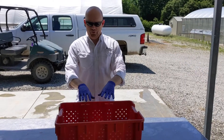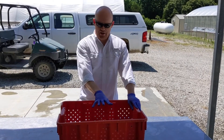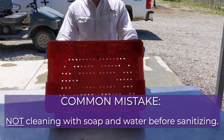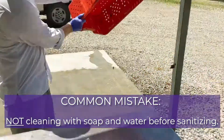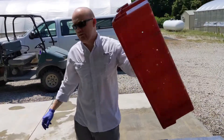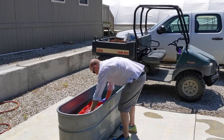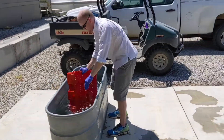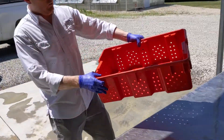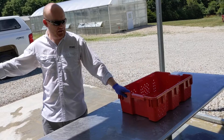Josh showed you the correct way to do it: remove your organic material, rinse, then do your detergent scrub, rinse it back out, and sanitize. A common mistake farms make is when they see organic material, they simply remove it by hand or rinse and brush and go straight to the sanitizer. That is not the correct way to do it. You're basically worse than where you started — you've contaminated your sanitation water with organic material and it can't work as effectively.